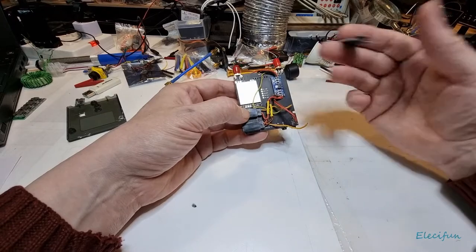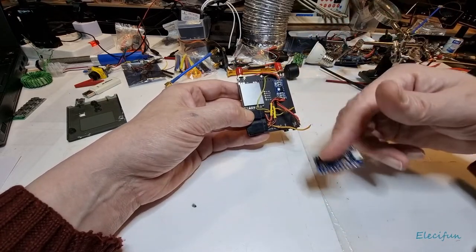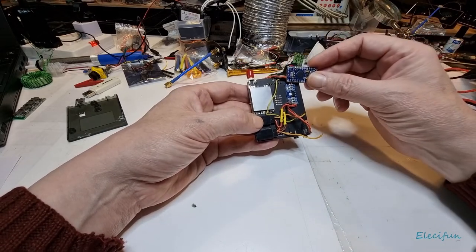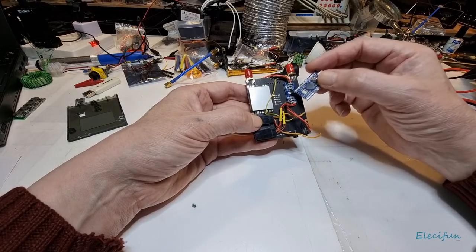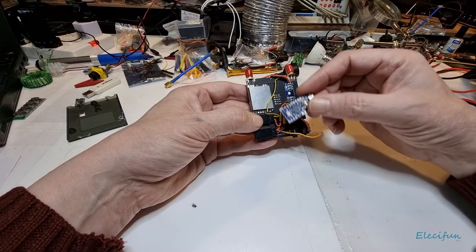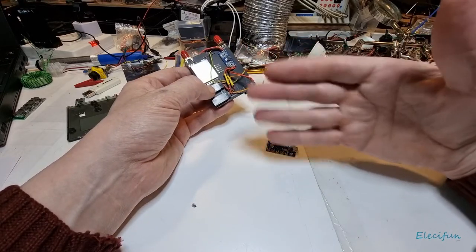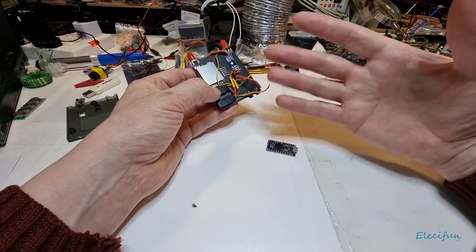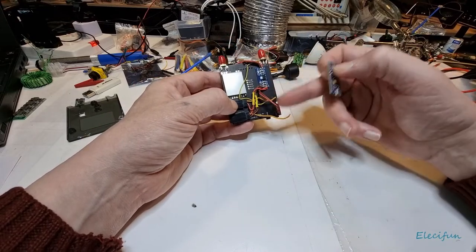So I've decided that what I'm going to do this time around is, this is my high voltage coming in, meaning from the battery pack, 3S, 12 volts coming in. Rather than have this one, because this will only do a maximum with ventilation of 800 milliamps. Now imagine the servo has gone into a bit of a jitter, and it's pulling a bit of current. Maybe it is, maybe it isn't. The weight of the antenna could be making it work a bit harder, and maybe that's caused this.